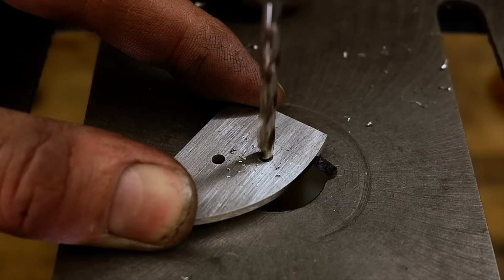Back to my blade, I grind in a slight false edge and a sharpening choil. The area between the sharpening choil and the finger choil is ground into an S-curve, and I slightly knock off the edges on a 45 degree angle.